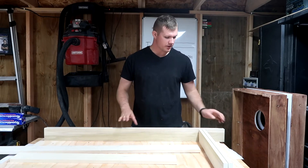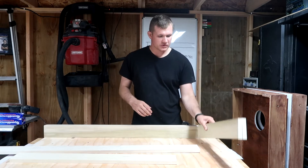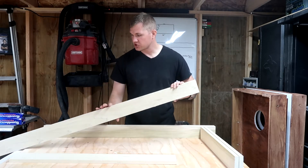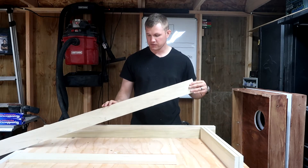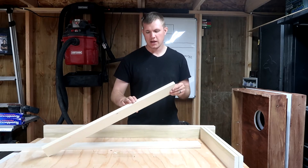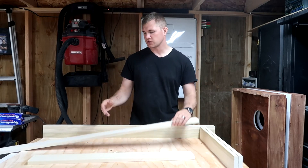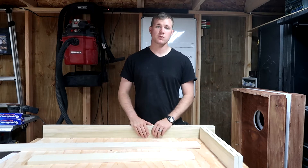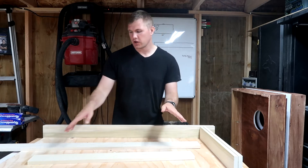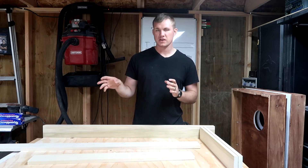The basics of the wood: I need two side pieces that go full length, two center pieces, and the actual plywood face. I use this sheet for the legs and the other piece for center supports — just one cut for the legs, two cuts for the supports. We'll go ahead and start assembling using pocket screws. We're going to do two screws on either end and then screws about every six to eight inches.